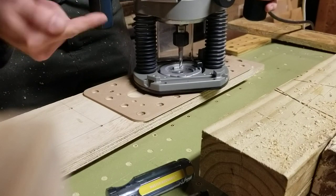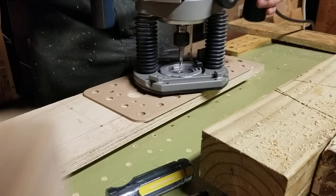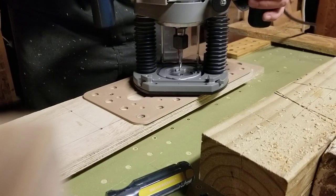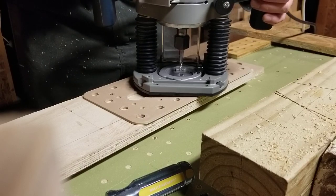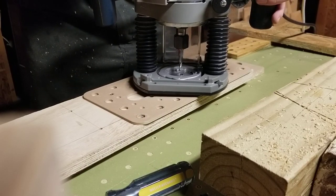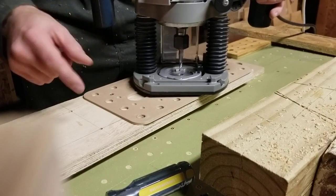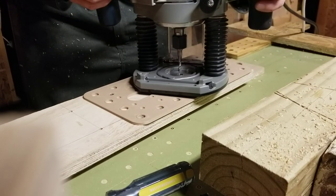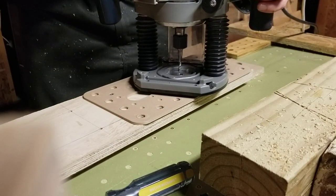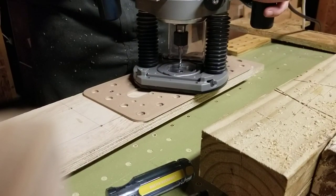Three-eighths of an inch less deep, which should put us at about a quarter inch, maybe a little less than a quarter, which is more deep than these counter bores need to be. I think an eighth would be enough, but using three-quarter inch plywood, I like to make things a little deeper than they have to be. That way you can use longer bolts, and the threads with the weld nuts have more space where they can overlap, you know what I mean? Here goes.